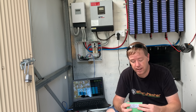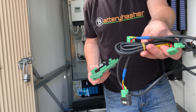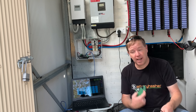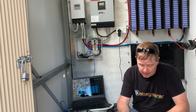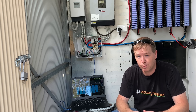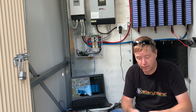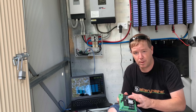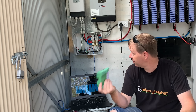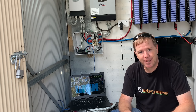I know better. It is clearly marked blue and red, and then the cables you get from Batrium — this is one I prepared earlier — are blue and yellow. Because all my cables are custom, I just screwed up. I swore a lot — that's why it's not on camera. I didn't record putting this one in or changing over all the Longmons, but I had to replace all seven Longmons. And this Watchmon just doesn't power up anymore — you plug it in and it's just nothing. So it's basically bin fodder. I'm hoping the expansion board's fine and I can just buy a Watchmon solo and get my rig back up and running, because this is mine from home. We were always planning to put the BMS in anyway. At any rate, let's get this installed. Let's do this.